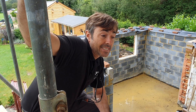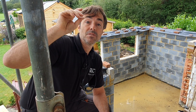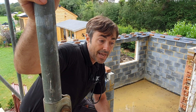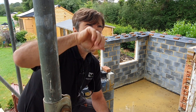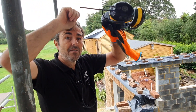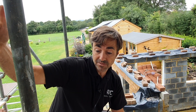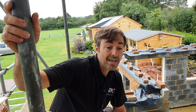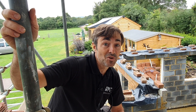One thing I might say, incidentally: it's really important — we sometimes drill beams upside down. So if you've got a steel beam above you and you're drilling into the bottom of it, use that. And it comes with a strap, and you have to strap the thing up. So first thing you do is hold it, magnetise it, strap it. Because if the power is killed for any reason — if something trips or the power is killed — that will fall off that steel. And I know it has happened to a really good mate of mine; it was the last hole he was drilling as well.